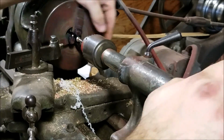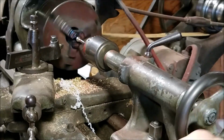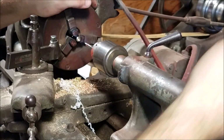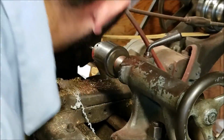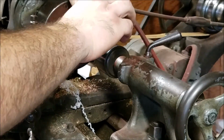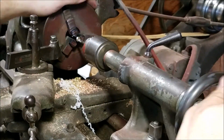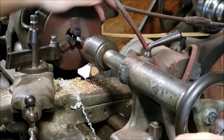It is actually extremely difficult to keep a tap straight manually. So putting it in the lathe and using the tailstock to chase it is wonderful. And of course, I wish I had a tap holder for the tailstock, but unless the shop buys one, I won't have one.